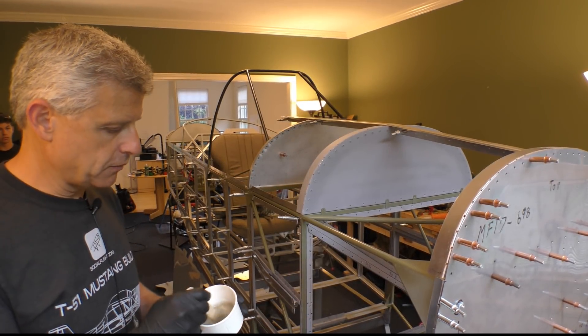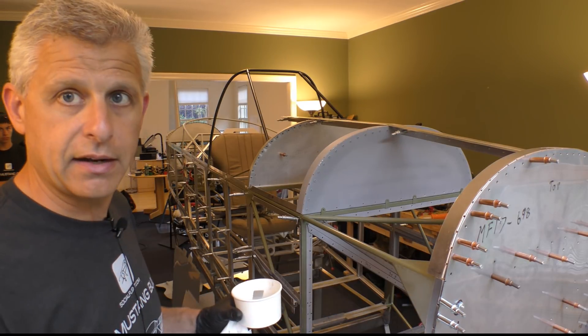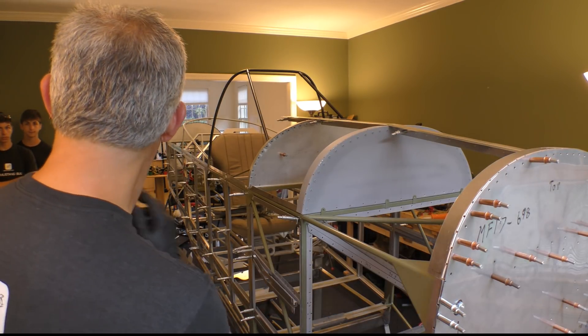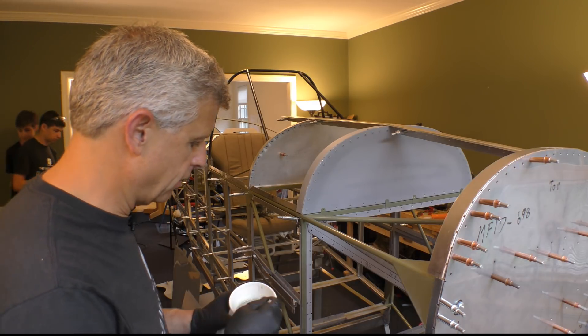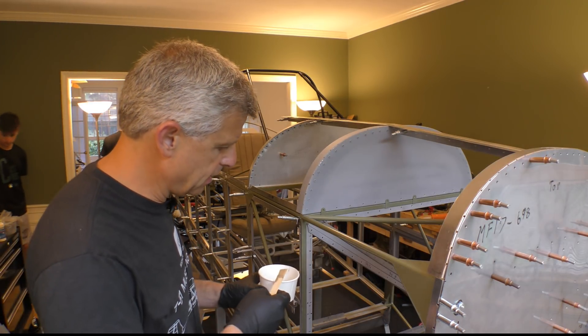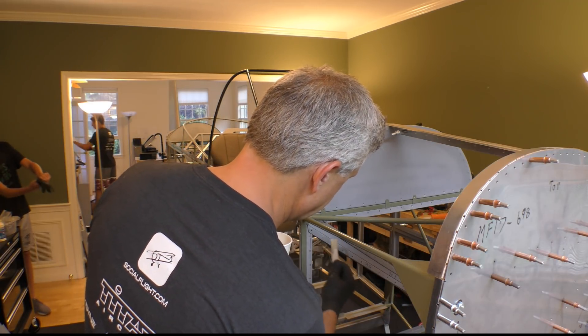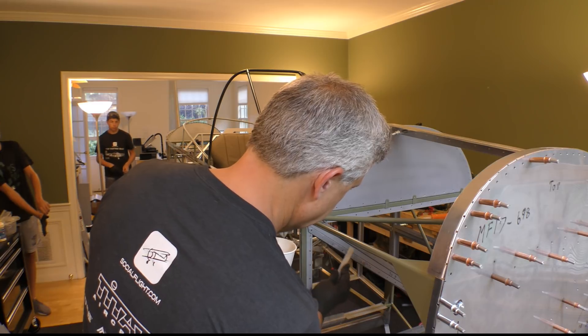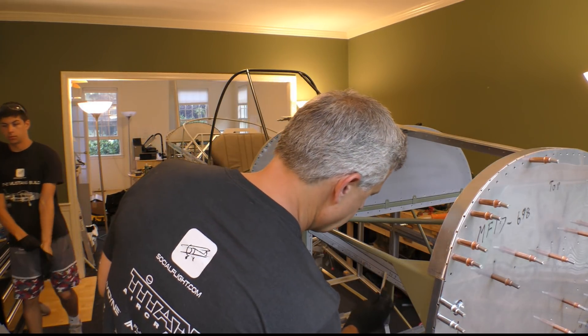We're time sensitive — we've got our Uralane sealant mixed up. Now it's time to put this number three bulkhead on all the pieces. I'm going to get some help from Jake and Ben so that we can make this happen pretty quick. I'm just going to put on a thin layer across all these places that the number three bulkhead adheres to.